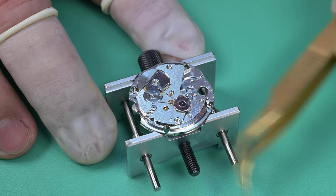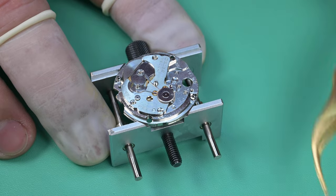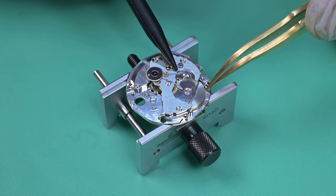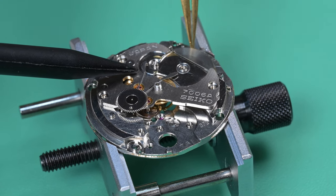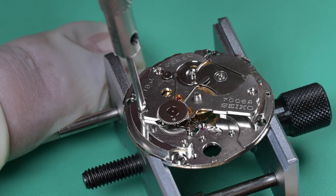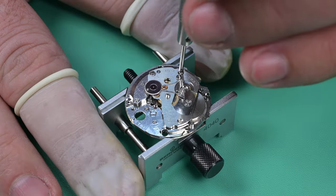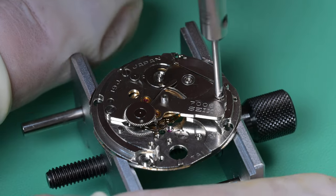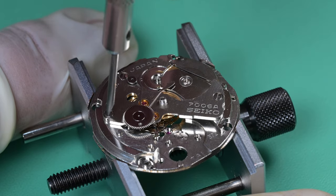You can shoot me an email — my email address is in the profile description — or leave a comment. We got the click spring put on and the bridge put on, and I'm using the little tap trick that we've previously documented on other videos. I didn't have to do any adjustments — all the pivots found their home with that shake. It doesn't always work that well, but when it does it's really handy. With that done I'm getting this first screw down and checking movement, then I'll put in the next two screws — not tightened but fully down — and then do a final tighten on everything.